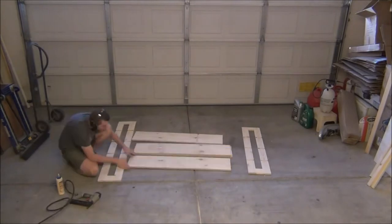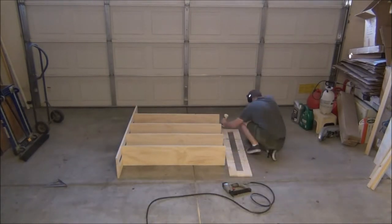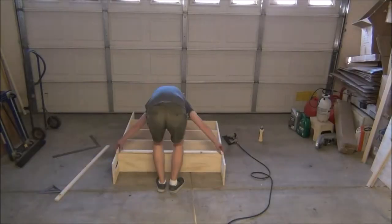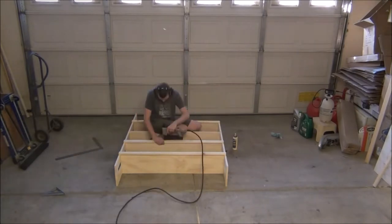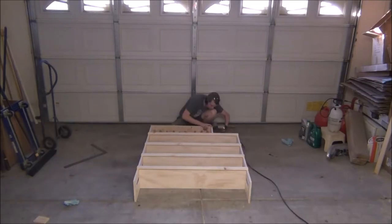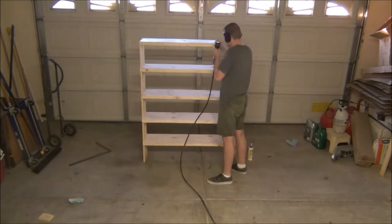After that, it is finally time to start assembling everything together. We're going to take our four 4-foot long boards and slide them into the channels we cut into our two longer rectangular frames, gluing and nailing everything in place. I'll then start cutting out and fastening on inch-and-a-half wide strips that overhang the face of each shelf - these not only look super dope but also help guarantee that the shelf stays square, eliminating any need for a backing. And with that, it is finally time for baby shelf! I've put our last 1-foot tall rectangular frame into the channel on the top shelf, put the baby shelf on top of that, and glued and nailed everything together.